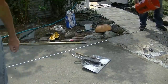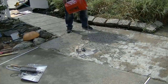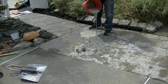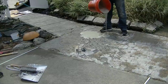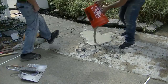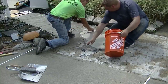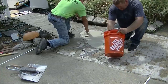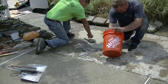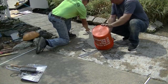If you put that set retarder pack in, it'll at least double your working time. We mix this stuff to about the consistency of pancake batter. When doing repairs, we just pour it right in there like Luke's doing right now, and then I've got a hand trowel and a drywall-style trowel — I'm just going to move that stuff around and fill in all the low spots and bad areas. What I don't want is to get the repair material too low; if anything, I want to leave it just a tiny bit high.